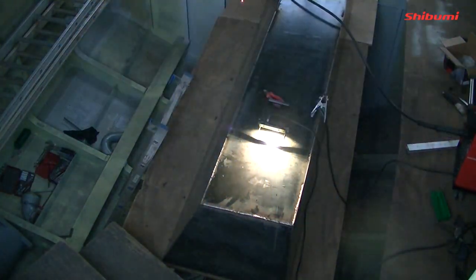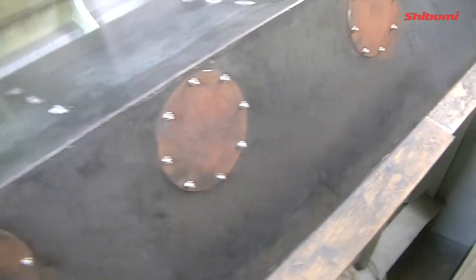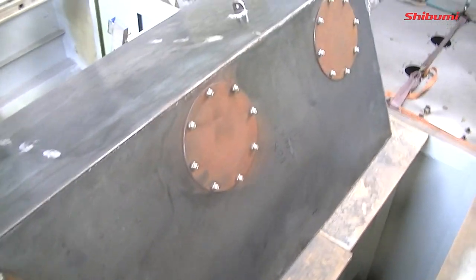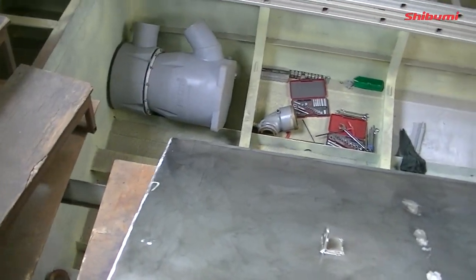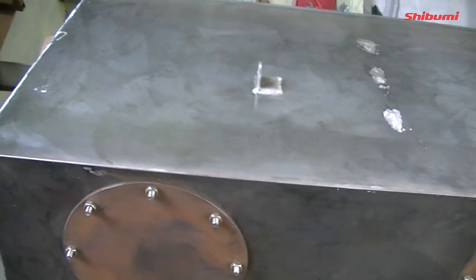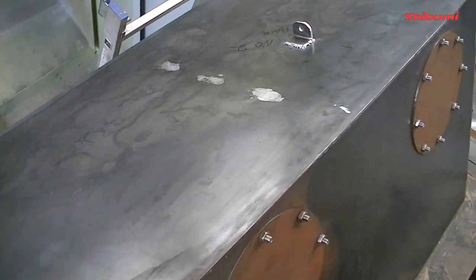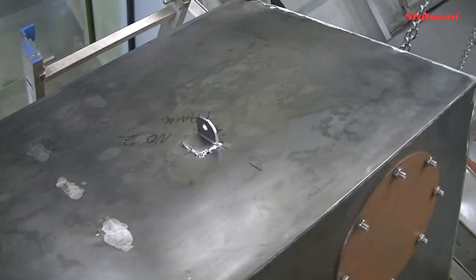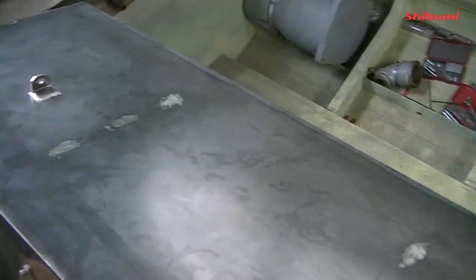This is tank one now finished. It's going to be lowered in the next few minutes into its temporary living in there, but it's going to be in there permanently when the bracketry is made for it. I've welded on two tabs. I've taken a guess using calculations on which side of center the actual amount of circumference of steel is, and they're within a couple of millimeters. So I'm hoping they'll be at least level.